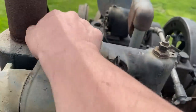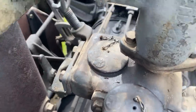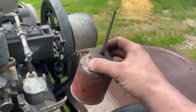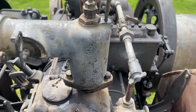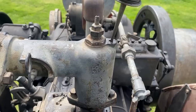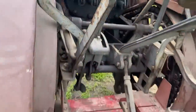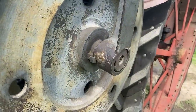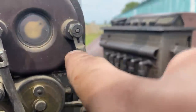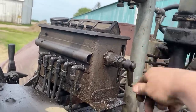You want the choke to be up in the on position. Your ignition timing — if you pull all the way back that's cut off; you set it about a third of the way forward. It helps if you have a little gas can like this: you can prime the fuel system. There's a little hole here — pour fuel in. Pour fresh gasoline in that hole there. Then everything up here is ready to go. Take your crank handle, bring it back here — it'll go on your flywheel and catch on to the key right there. Look up here on the magneto: when the tab is in that position, it's ready to fire the spark plug. Grab your oiler and give that a few cranks.